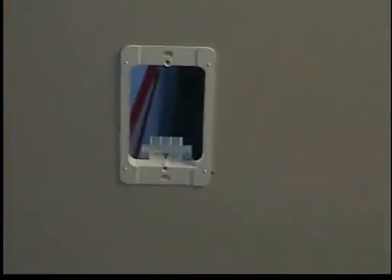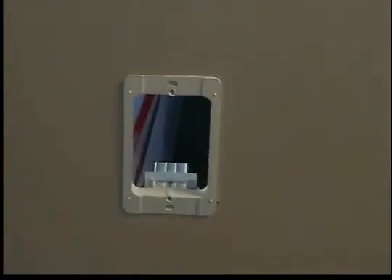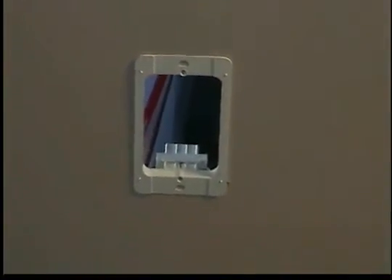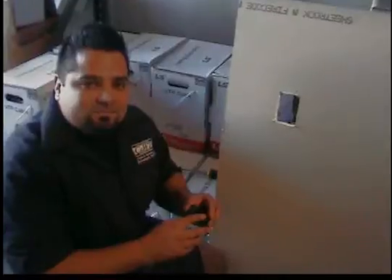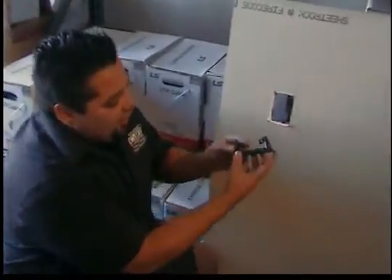The main complaint I've heard about this ring — and it varies from contractor to contractor — is the plastic. Once you put your face plate on, it will sit out a little bit more than the other two style mud rings. Also, the screw holes are kind of a hard plastic, so if you're using a screwdriver manually and not a drill, it will take a little bit of effort to screw it in.